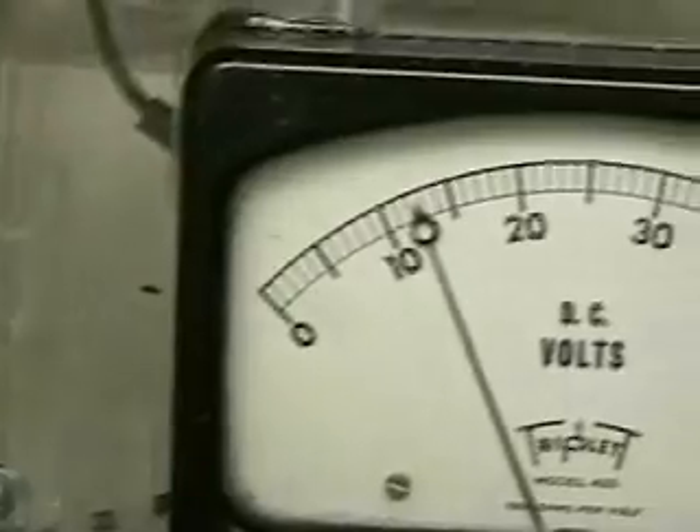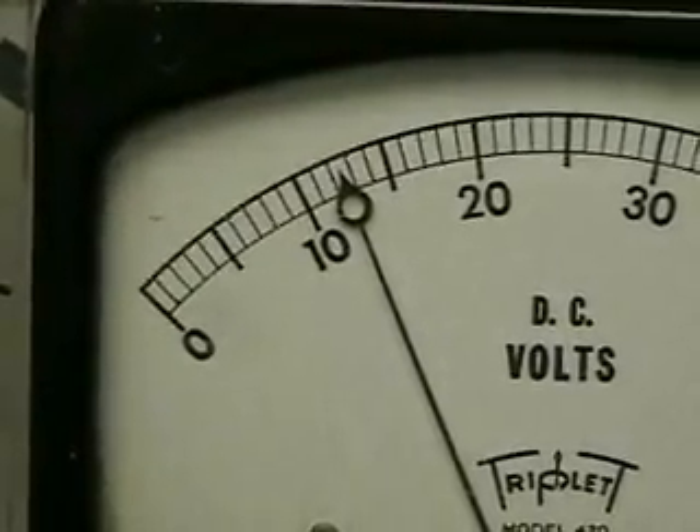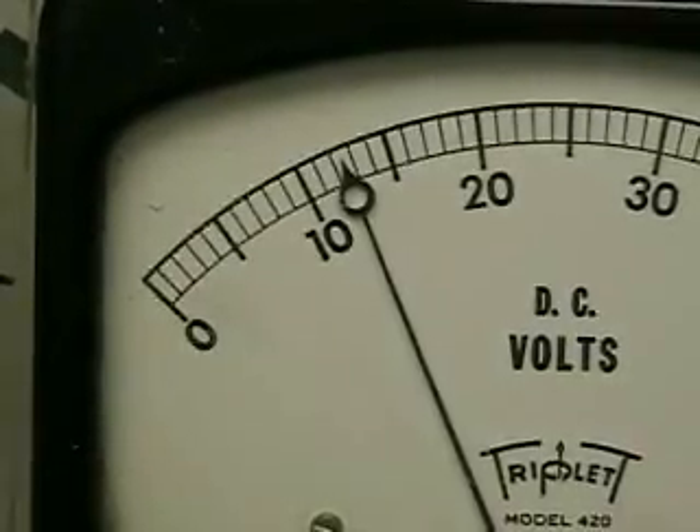For the 3L system, if you go to hydrogentap.com you'll see the outputs and the temperature of the water. The ideal for this system would be running at 30 amps. Remember there's no electrolyte — this is running on straight tap water, which has been the goal all along. You can see we're only running at 12 and a half volts.